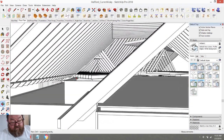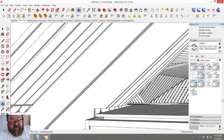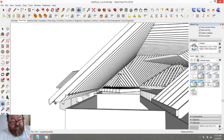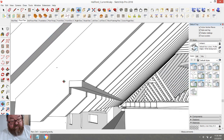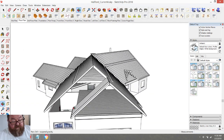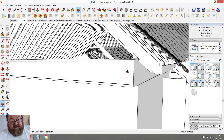But I haven't got my plate down here yet. You can see that the rafters are still sticking up 1.5 inches because I don't have the plate there. Lots of little details to check on here. I do have the plate over here that those rafters are going to sit on. But for now, we got to get this floor system. I got to check this floor, because I scooted it over, so now I got to move this back.